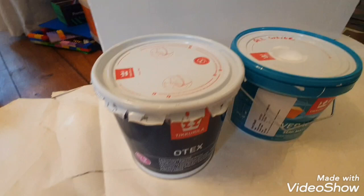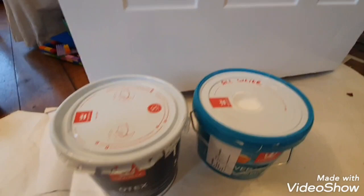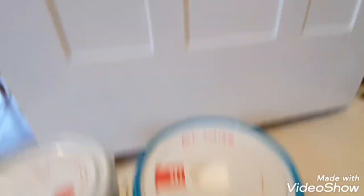You can see the difference already on that panel. Okay, this is the finished product - as you can see, nice satin finish, nice and even, solid. That's all you need: Otex solvent, Everal Aqua 40 water-based satin, mixed all white Farrow & Ball. Two of each product gives you this over a glossy varnish surface. If you haven't got a Mirka sanding machine you can do it by hand with sand pads - as long as you key in between each coat you'll be fine. Thanks for watching, please subscribe and like the video.